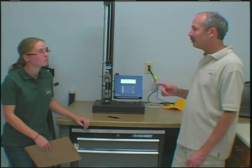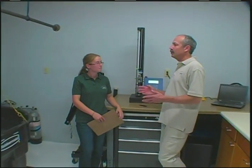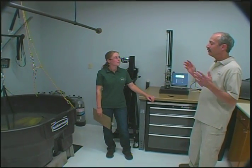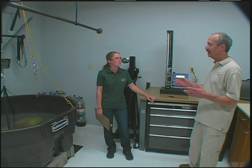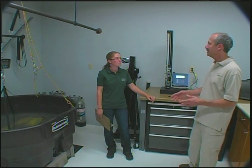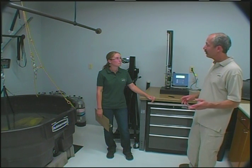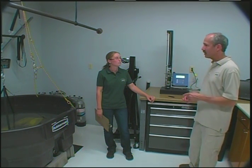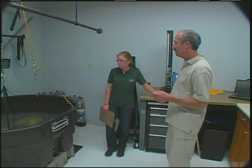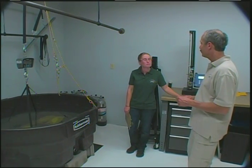The medium air retention buoyancy test is a six-hour long test which we started earlier today. What we do is we weigh our basket in the buoyancy tank, then put an air cell under the basket, and let the pressure and temperature of the gas inside the air cell stabilize with the water temperature in the tank. We actually have to record the barometric pressure at that time too, because six hours later it could be different. At the end of the test, we record the value on the scale, and the stabilized final buoyancy of the device cannot have altered more than 5%.